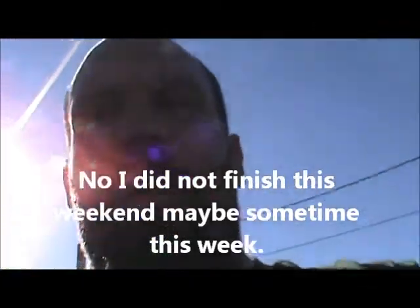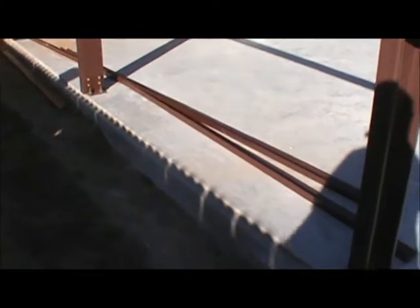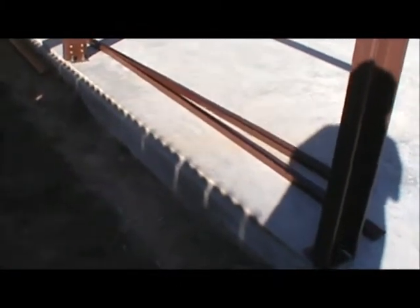Jennifer, I didn't get, and I don't know if they forgot, and I'm going to call them, I did not get the drive pins. Sorry, I was trying to think of it. That you put in the concrete, you drill a hole in the metal. You drill your holes every 36 inches, it says, and then drill a hole down however deep the drive pins are, and put the metal down, put the drive pin in, and hit it with a hammer and lock them down. I did not get those, so I had Jennifer buy some of the kind that you drill the hole, you put them down in, and then there's a nut on top, because she couldn't find any. The biggest drive pin she could find was 1/4 inch, and that's not big enough, I don't think.